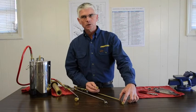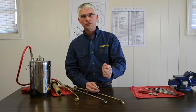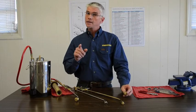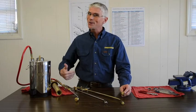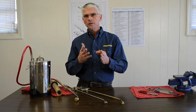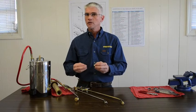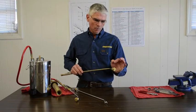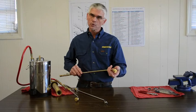These generally have a long service life. So when you have a unit that continues to drip after you've applied material, that generally is going to be an indication that you've got a bad seal or seat of the seat stem. And what that generally is derived from is trash over time, grit, not cleaning the strainer on a regular basis. But just over time, naturally, depending if you're using wettable powders and those kinds of things, by nature you're going to have a certain amount of seat integrity that's lost by the flow of chemical, and that can be enhanced by not cleaning it regularly. But it's generally going to have a long service life. That's the first thing you want to look at when you have material dripping out of the end of a nozzle.